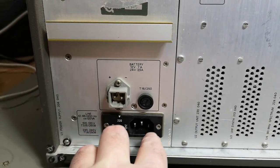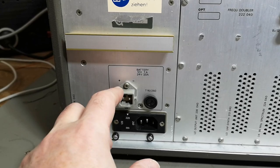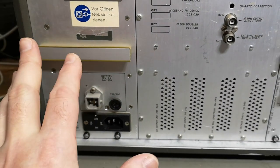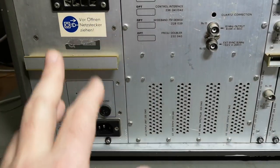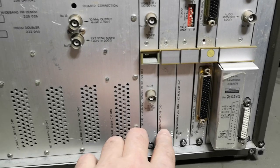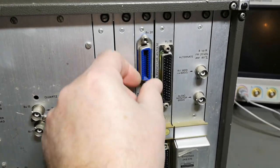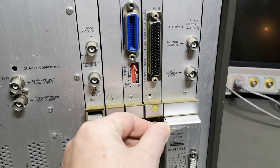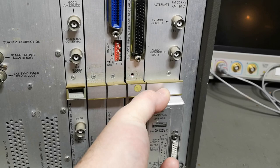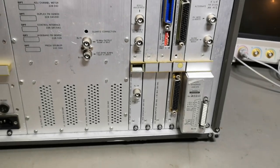It's actually full of switch-mode converters. First there is a conventional power supply, and then we've got four main switch-mode power supplies making all sorts of voltages. Since this is from 1994, it's probably full of capacitors that need to be replaced — that's also very interesting. We've got all the different plug-in modules here screwed in nicely. This one looks like a 4 kHz band-pass filter, and this one is a little bit loose — maybe it's supposed to be like that. Let's power it up.